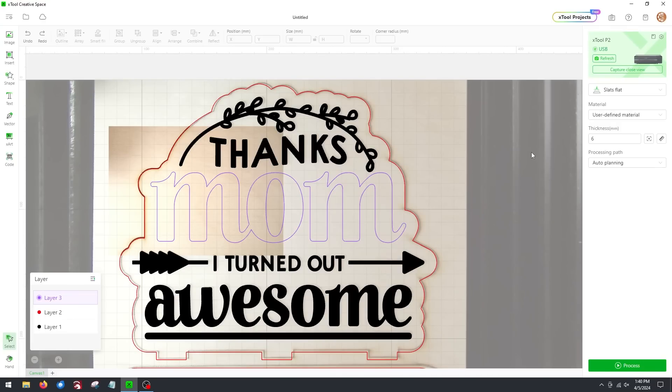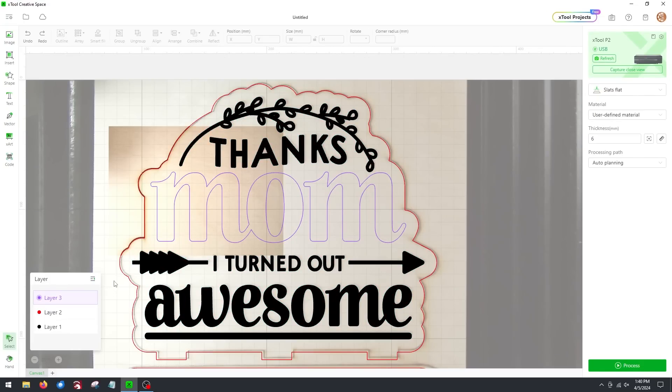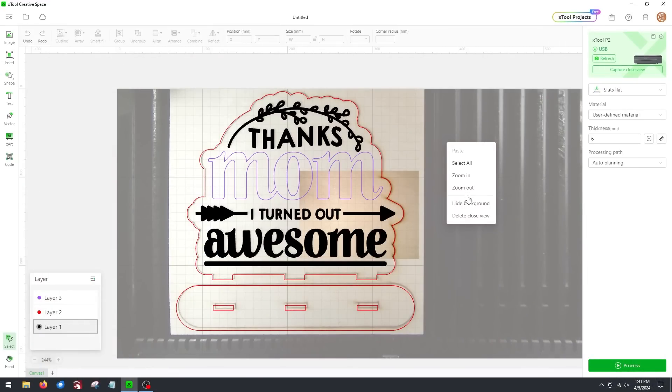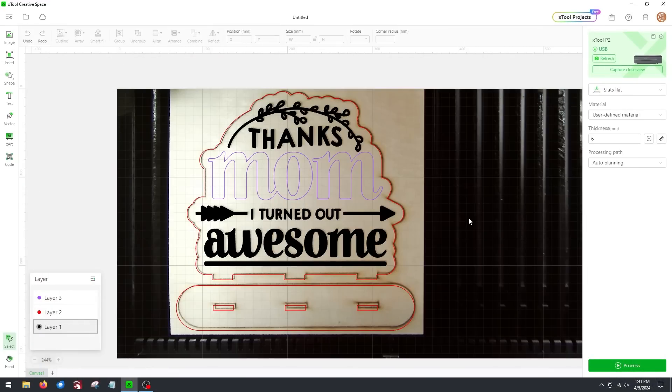I'm comfortable with this layout. Notice: with the wider-angle lens it looks like it's not lined up, but with the close view it is lined up. That's why you want to use the close view for your alignments. To get rid of the close-up view, right-click and choose Delete Close View. It takes us back to the normal looking screen. Our alignment is good — even though right now it looks off, we're going to trust the camera and fix the settings I intentionally made wrong.